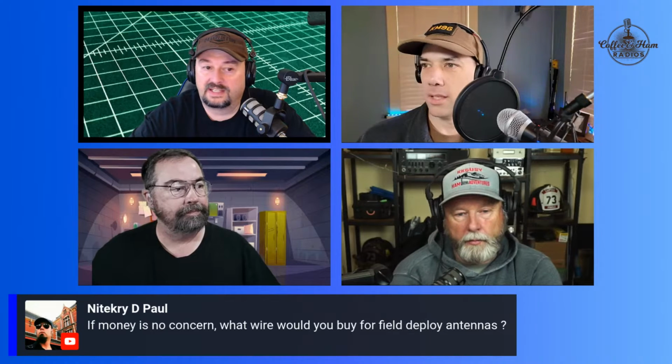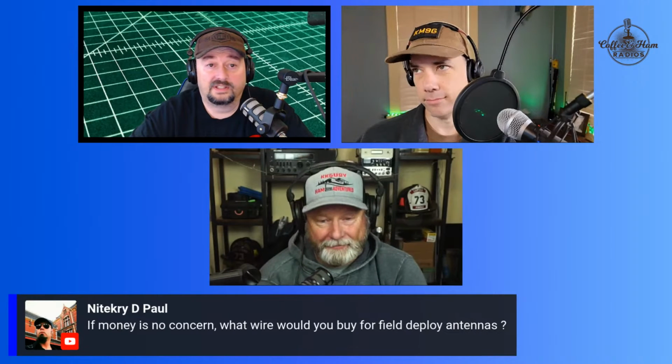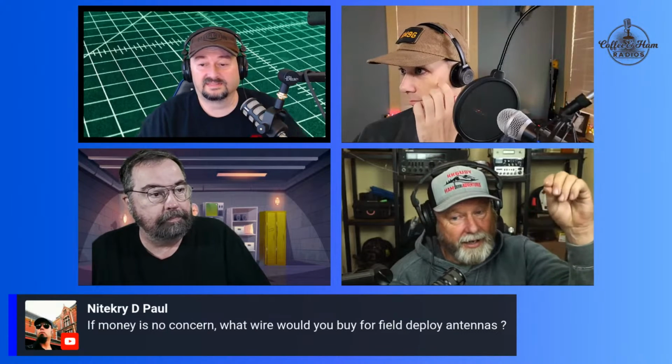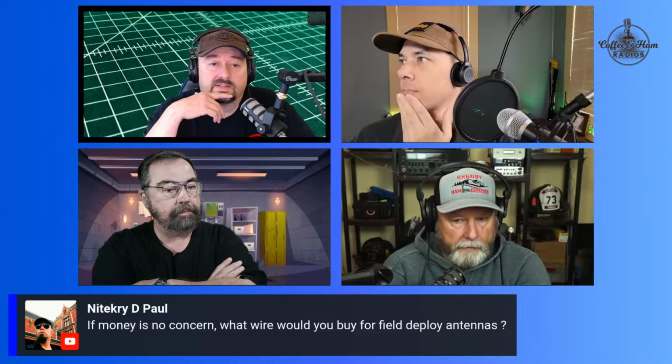Somebody was asking a question about cash. Here we go: if money's no concern, what wire would you buy for a field deploy antenna? Well, I really like the BN for field deployable because it doesn't kink, it doesn't tangle, and it's light. That silicone wire, sometimes if you just shake it, it comes apart. But if I was setting up a home QTH antenna, then I'd use the PolyStealth from the wire guy.